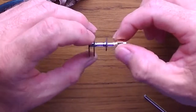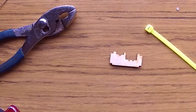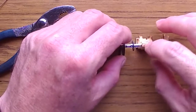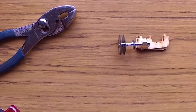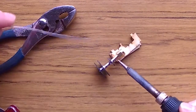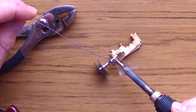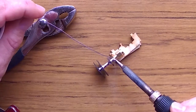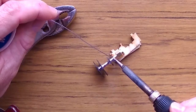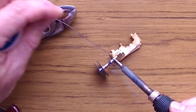So what we're gonna do next is solder the connector to the cable. The way that I do this is I get the two parts of the jig and put them on top of each other, and I just place the antenna there, so it's easier for me to tin the cable. I apply heat and put a lot of tin there until it becomes kind of liquidy, and by that time it flows into the cable and around the cable, and you don't have to be doing much with the cable.